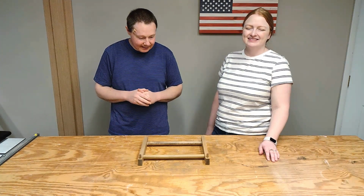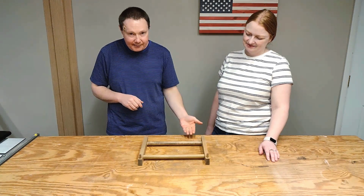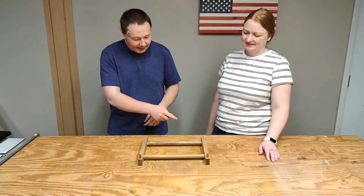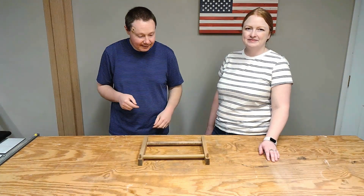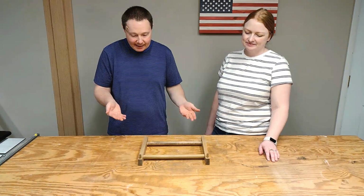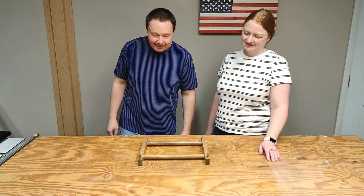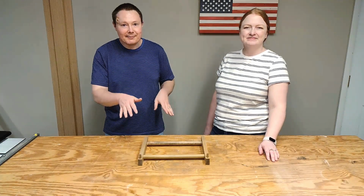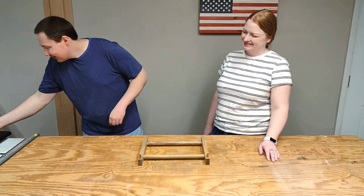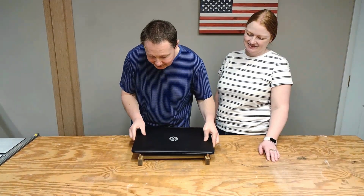but it probably needs to be just a little bit steeper. And I never mentioned this before, but the dowel positions, they are 3/4 of an inch up to the center from the bottom and 2 inches in from each end. And the center of these is just 1/2 inch in from the end and center of the board. But yeah, probably with your camera view here, you probably can't even tell there's an angle really, but there is somewhat of an angle. It just needs to be a little bit steeper.